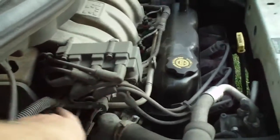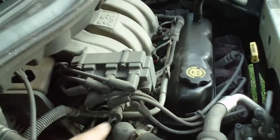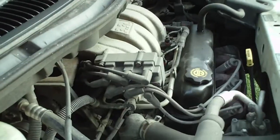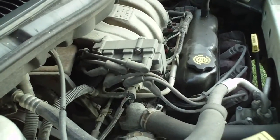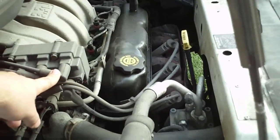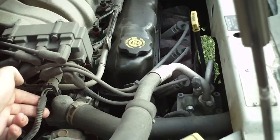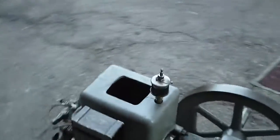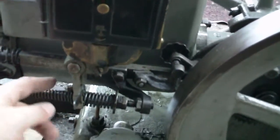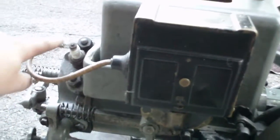The ignition system on some older cars will have a wire running into the center of a round distributor — that's a mechanical distributor which distributes the spark in a circular pattern by a mechanical movement of a wiper. Those are a little more finicky than these new electronic ignitions. But in everything you're going to have a supply, a line to transmit the ignition to the plug, and something to control it. Here it's controlled by a computer; on the old engine it's controlled mechanically by this rod moving back and forth, tripping the actuator which trips the magneto and sends the spark down the wire.